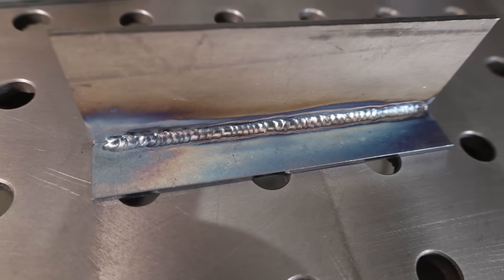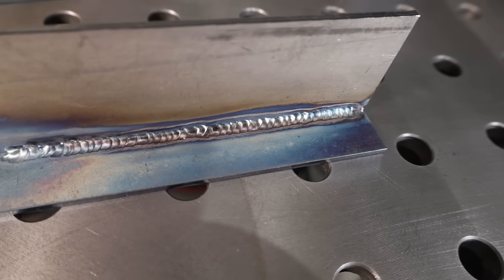As far as cost goes, there's a gas cylinder similar to MIG welding, and TIG welding machines are in a similar price range to MIG machines — with the alternating current options being on the higher end. So you're fairly similar there in terms of price and portability. One thing to keep in mind is almost all TIG welding machines can also be used to stick weld, so I've taken my TIG welder before and just used it for a stick welding job — that's an option for you.